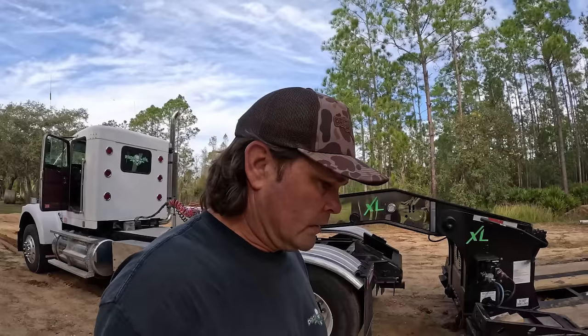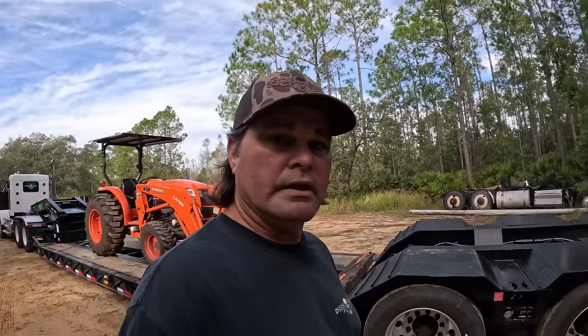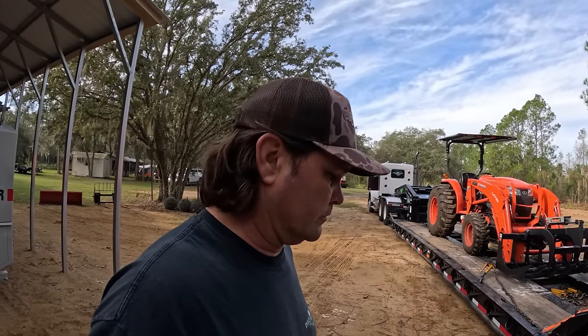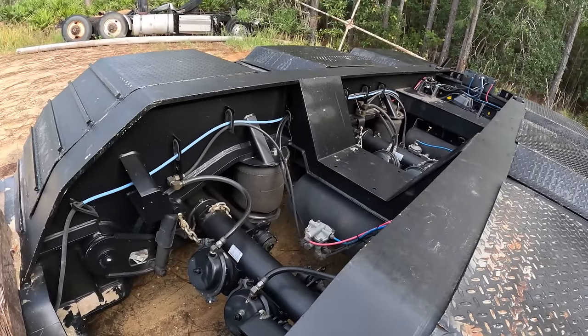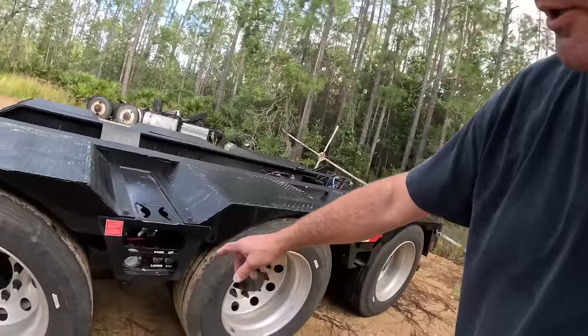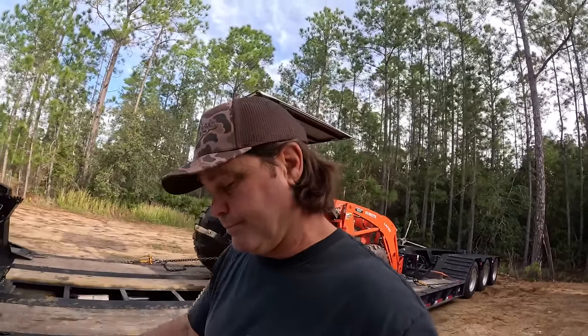While I was backing up I got a phone call — gotta go move a big boy, 360 track hoe. As soon as we drop this off we'll head that way. And then we still have the other skid steer they're still waiting on. It seems to be acting right today — the brakes were serviced yesterday, just the air brakes weren't. They seem to be airing up good. We had a little problem with this valve right here once before acting up. I suspect that's where the problem is. We got one ordered, or we're in the process of ordering one, so we'll have one on hand.